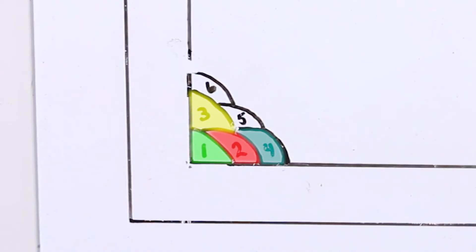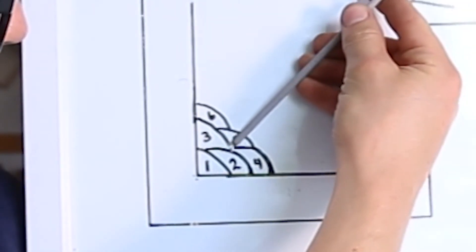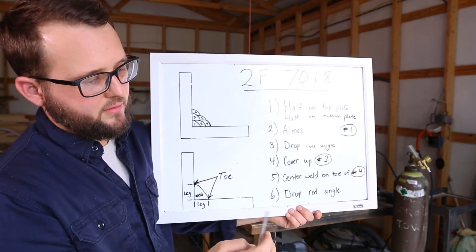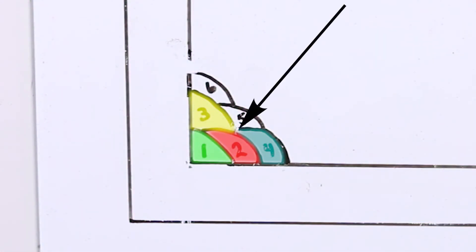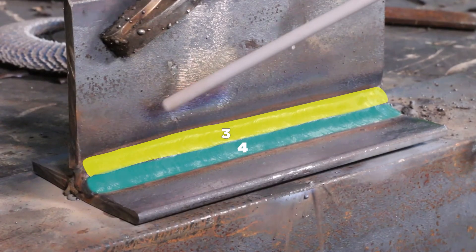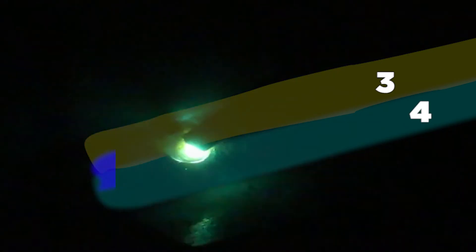For number five, you're going to use the toe of four almost like a center line to your puddle. Put your rod right there and split it evenly on three and four. I visualize the metal rod inside all that flux being split evenly right on the toe of that weld — it keeps me straight. On that pass, you don't want to go too slow because it will droop down onto four, but you don't want to go so fast that you're underfilled. Go just a hair faster than you might on the other beads.